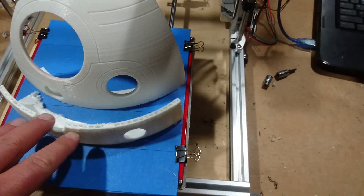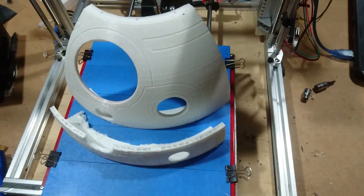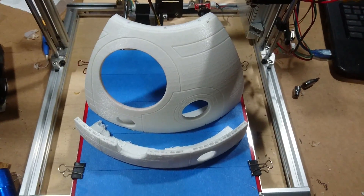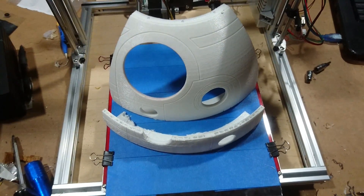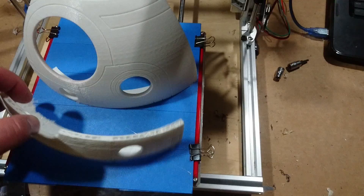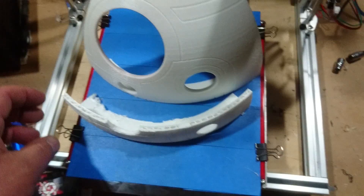So initially when I printed this out, it ended up being backwards because the x-position on the system was set up backwards according to their instructions. There are a few ways to fix that — you can move the end stop from one side to the other, reconfigure it in the software, or some other things. Anyway, I got that figured out, switched and fixed. This is the original print that was backwards, as you can see from the other one there.